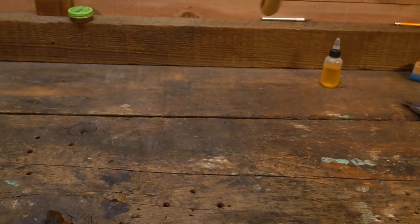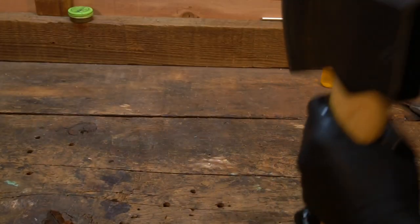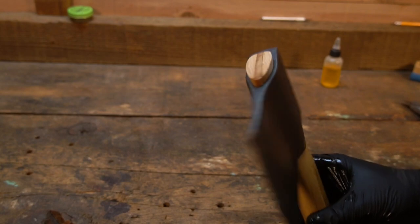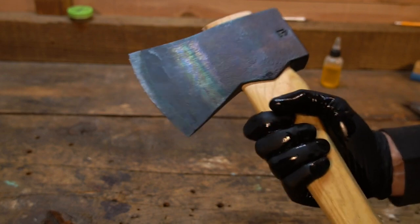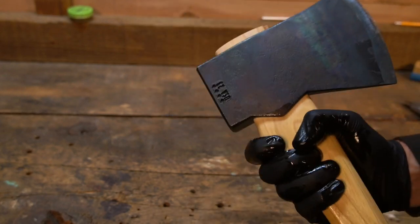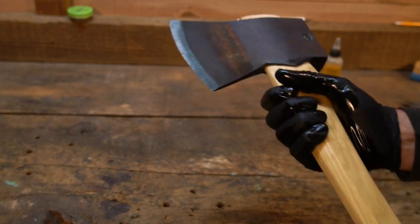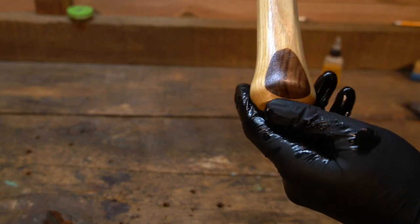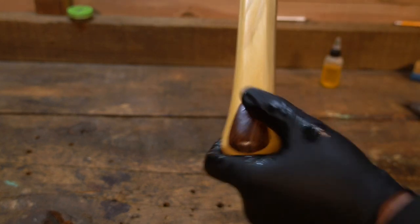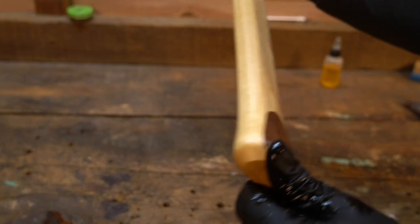Oh, look at that. Initials. That's pretty cool. He's going to like it. Yeah, I think I'm just going to put it in a small container of glycol and just soak it for a couple days. I know Wiseman Trading, I think they're out of Arkansas or something like that, they did a test with just about everything you've ever heard of soaking a striking tool with. Dipropylene glycol was the winner. But I think he put some water with it, so I guess I'll have to do some looking.